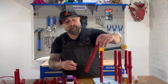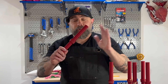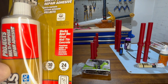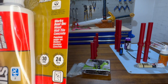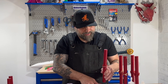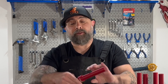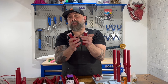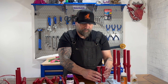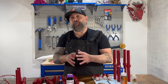Let's take a look at the liquid nails. You can see the liquid nails pushed out past the part that was adhered. After 24 hours, it actually looks a little damp still — I don't even want to get that on my table. The liquid nails broke really easily, and on the twist test, same thing. It's been 24 hours and it looks like this hasn't even fully cured — it's actually really wet. So the liquid nails failed on both tests.